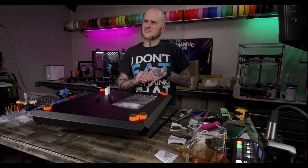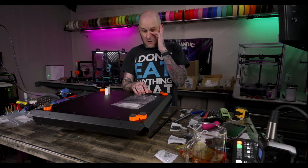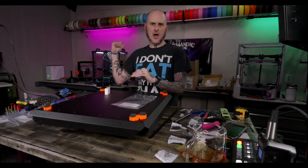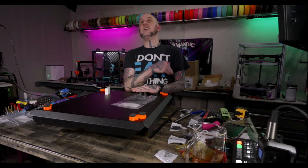You also mod everything, yeah. What changes did I want to make to G2E? I wanted to try and create a little bit more movement in the pivot mechanism. Honestly, the biggest thing I wanted G2E CAD for was two things. I had to make my own PG7 mount, a mount for the cable gland for my umbilical. I was able to do that just based off of the motor, and I actually measured the clocking of the motor, so I was able to custom do that. I got that done. I was able to get both things I really wanted done that CAD would have made my life infinitely easier for.